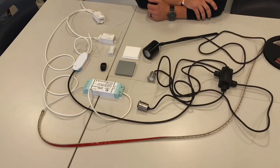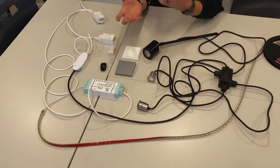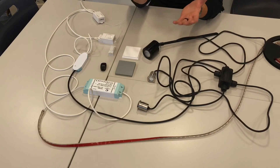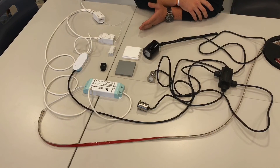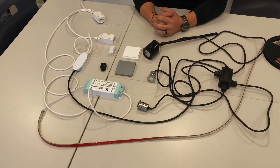This is making massive improvements in the ease of installing outside garden lighting. Before, the ways of switching garden lighting were quite primitive, or you had to run cables back to a suitable location — chasing out walls in kitchens by back doors where people could access the switch. Now we can mount the receivers anywhere within the garden and operate switches — up to 10 per receiver — from up to 20 metres indoors and over 100 metres outdoors.